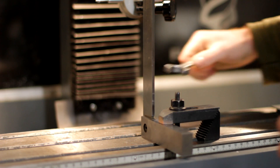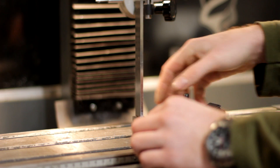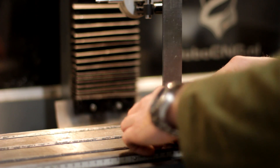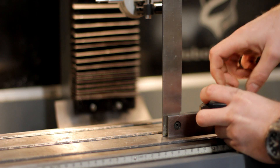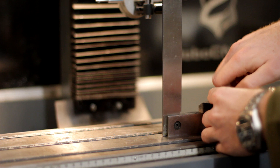So now the column is done in the Y direction, we need to reset the setup to check it in the X direction. I am not going to show this complete process since it is basically the same. The only difference here is that this direction does not have to be shimmed — some gentle taps with a dead blow hammer taps it into alignment.